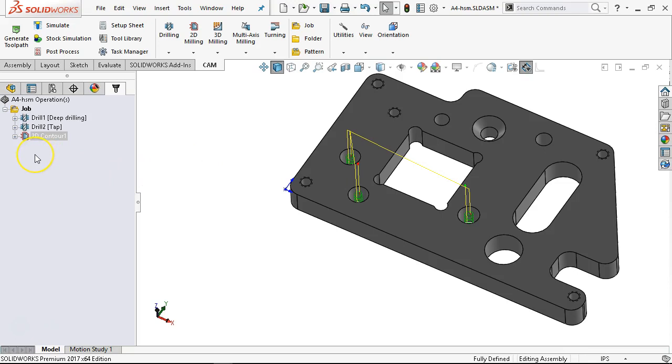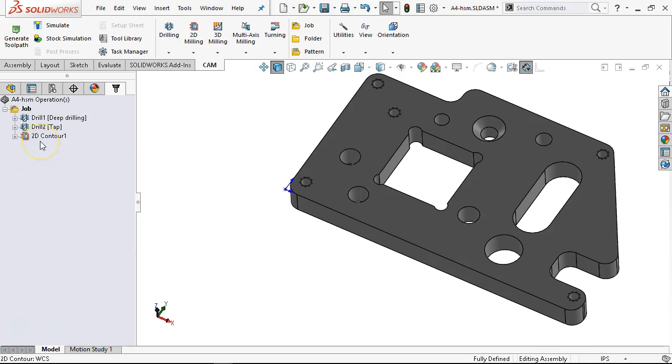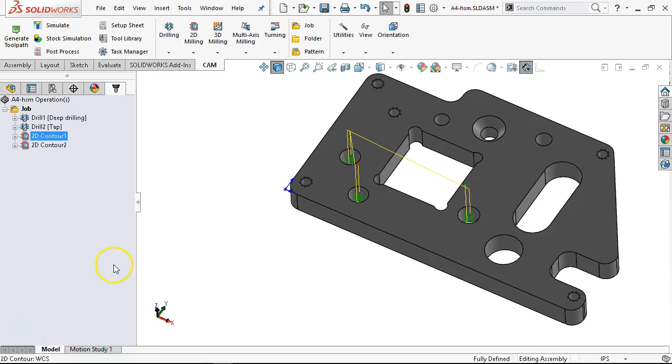Or you changed your mind during the setup, or somebody else set it up and put the clamp in a different position and didn't follow along. So we'll pick a couple more — let's do one more with the bore and look at the roughing passes. I have all of those settings in place and I don't really want to start a brand new operation.